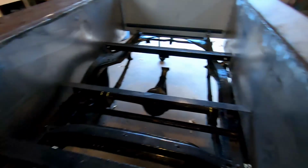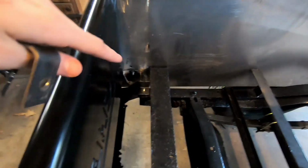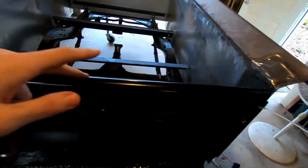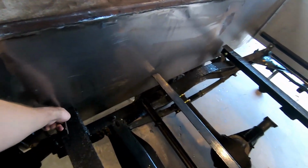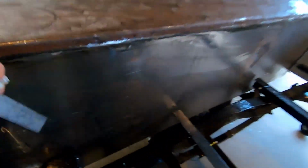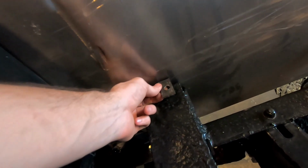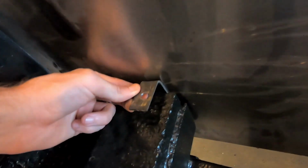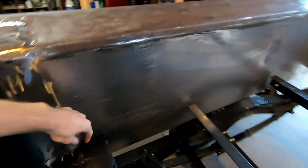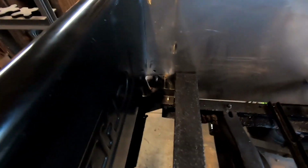And then once these bedsides come off, then we can go ahead and get it fully welded how it needs to be. So after we do that, while we have all this on here right now, I'm going to work on getting the side pieces that will hold the boards down that are going in the bed. So my plan is, basically, I'll just use this as an example. I'm going to take a piece of metal and come off these vertically right here. So I have a little piece going up off of each of these, and then I'll drop it down and have a piece coming off of it like so that will overlap over top of the boards to hold the edges down. So that's my plan, and I'll run it along all four sides, and then I'll put some little loops on it on each corner as a tie-down point. I think that'd be a really nice thing to have in this. So yeah, that's the plan.